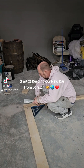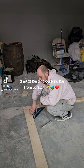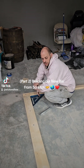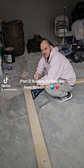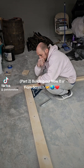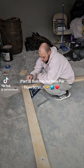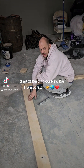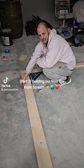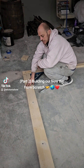Another thing I want to point out: instead of using a nail gun, we wanted this to be screwed — we wanted it to grip very tight. So we went in here with a Bosch hammer drill, piloted out these holes, and set Tapcon screws down in here. The Tapcon screws were four inches to allow for the inch-and-a-half thickness of the board, then we're about two-and-a-half inches deep into the concrete.